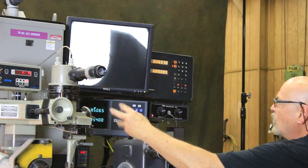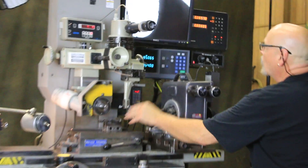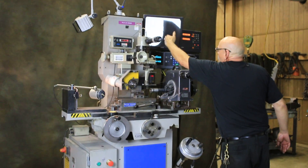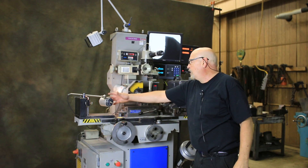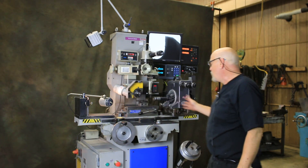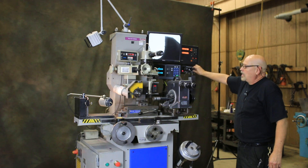You would dress with this to get your wheel to that kind of a shape, then come down and grind your workpiece, and you can actually watch your grinding wheel come in and make that. It has a light over here that reflects back across your part like a comparator, with variable lighting so you can change the lighting level.